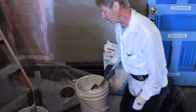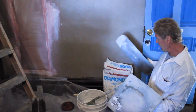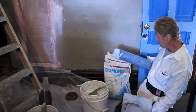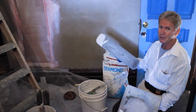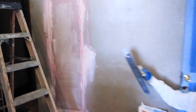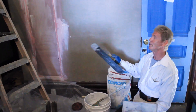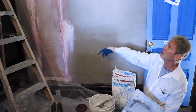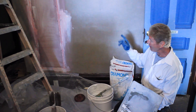The thing I'm going to answer today is: can you just go one coat? Technically, when we put this product on — and by the way, in the UK they call it skim plaster, that's a better terminology because all I'm going to do is skim this. This is an old house, about a hundred years old, and what they had here was old wood lath. He just put sheetrock over that; he didn't have to. We could have skim coated right over the wood lath after we prepped it.